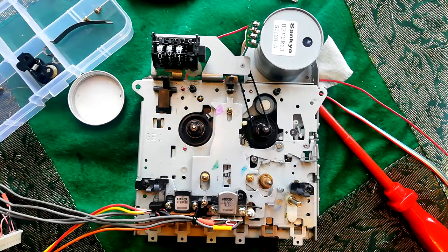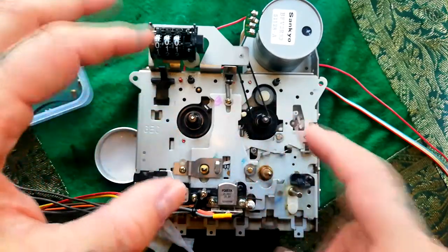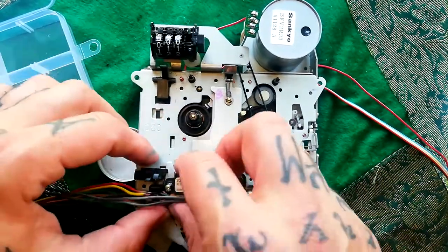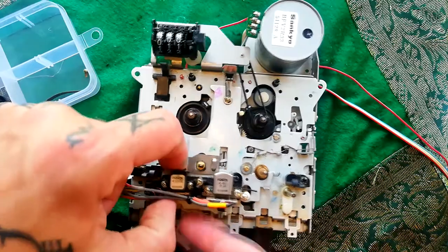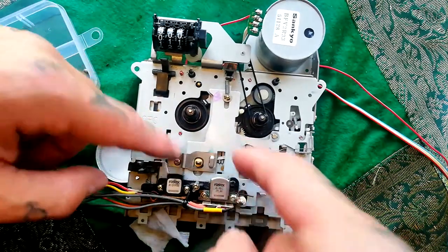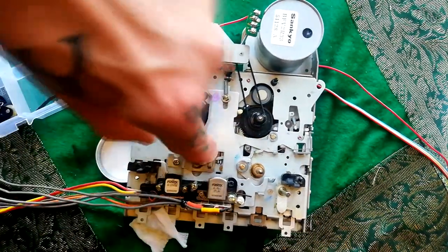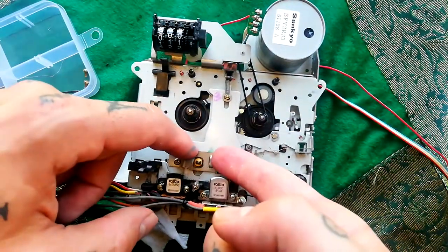At that point you can start to replace the various washers and e-clips. To quickly talk about the purpose of the various plates and rings that were removed: this ring here stops this plate from tipping out that way; this ring and washer stops it from tipping out this way. That protrusion that fits under this bit holds the cassette upright and also stops it from coming out that way. The bearings allow it to slide. This plate here — if it weren't there, the force of the cassette could push against the plate and cause friction, whereas the cassette body is just going to hit that tab, so it doesn't matter how much pressure you put on there.